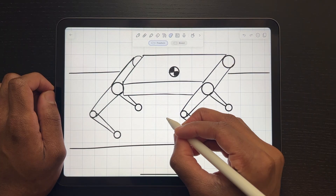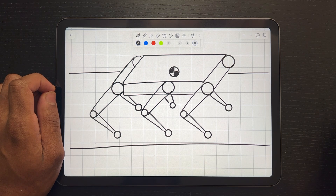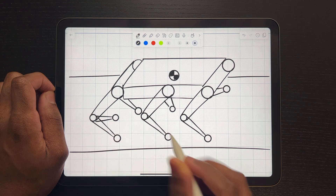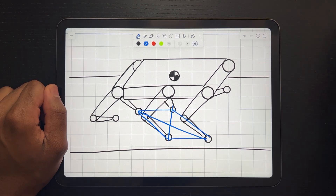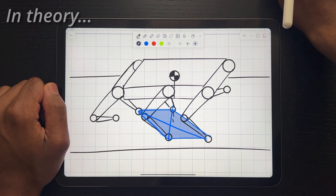The reason why this is important is because if we look at a hexapod, which has six legs, there are a lot more ground contact points. So when some of them are removed, such as when walking, there's a less dramatic effect on the stability of the robot. Which means in theory it should be a lot easier to make a stable hexapod.